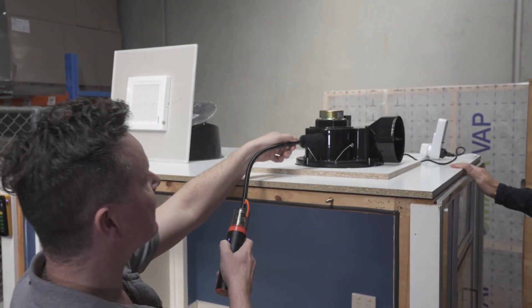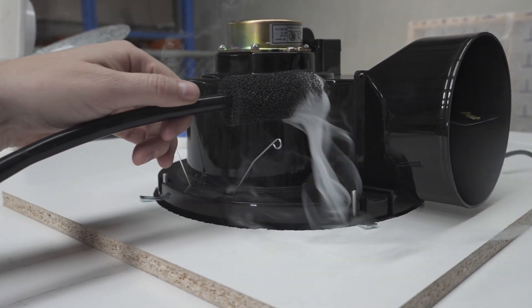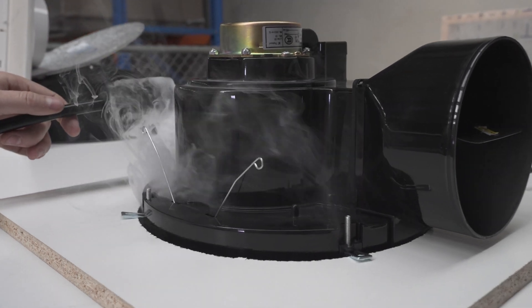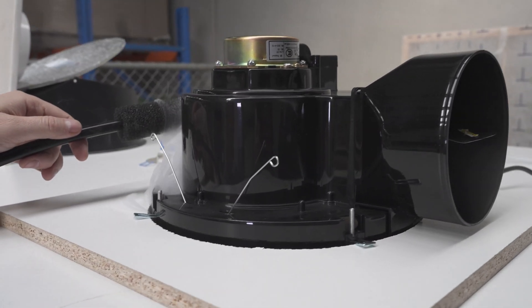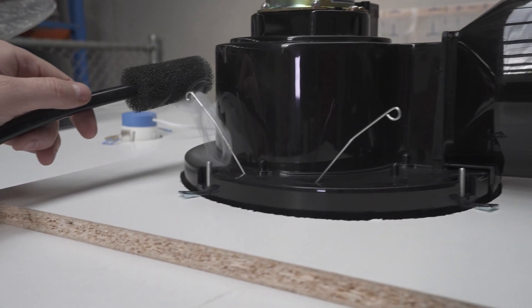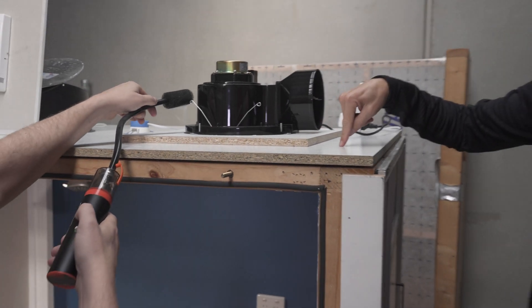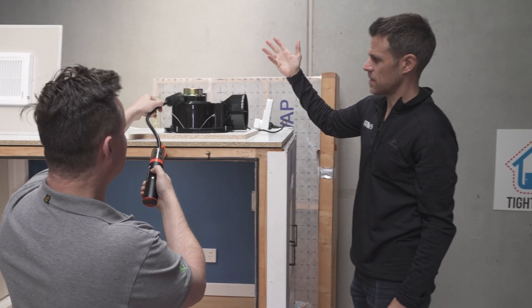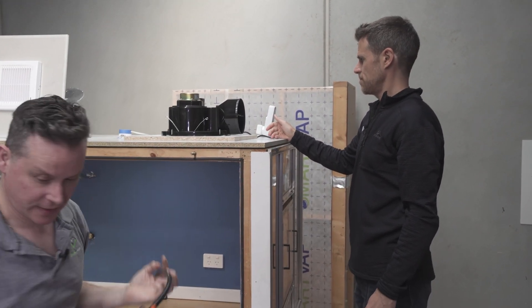So you've just powered it on. Any restricted airflow in the house will just force more and more air to be exhausted directly from the roof straight through this exhaust fan. There's a lot of leakage in the housing itself, so it's drawing air not from the house but from the attic. It's not doing anything good, not helping anything. This fan will fill up with insulation fibers in no time. Let's pull it down and check the airflow.